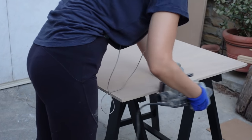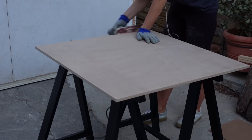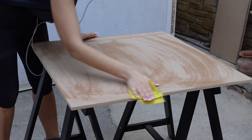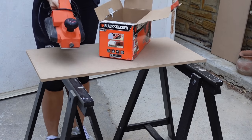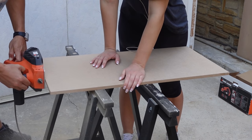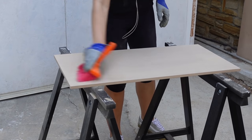I sanded all three panels with 120 grit sandpaper, making sure to sand the sides as well. My initial thought was to shorten the sides with 80 grit sandpaper, but sanding just a few millimeters took quite a while, so for the panel doors I used a planer instead. When done sanding each piece, I wiped it clean with a damp cloth — make sure it's damp and not wet, because MDF is incredibly porous and soaks up moisture quickly, which can cause it to expand. Once I brought each panel door to the correct dimensions, I sanded both sides with 120 grit and wiped clean again.